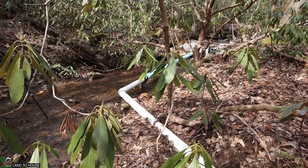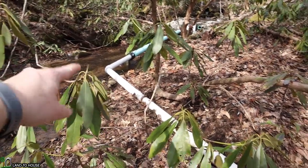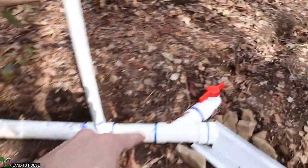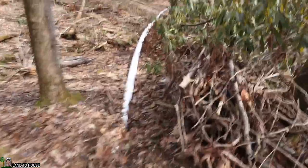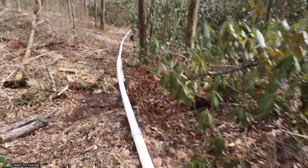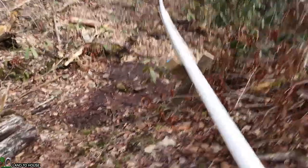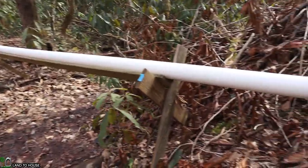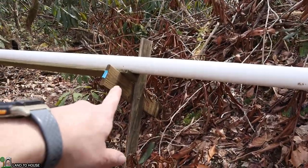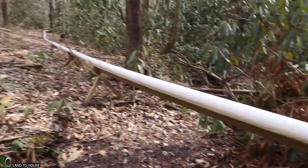This particular creek can have flood stages with over 700 gallons a minute, so the homeowner has moved the pipe away from the creek. It now travels down over here and will return to the creek after going through the turbines. A simple bridge system has been made to allow the pipe to go over a little dip without creating a spot that rises back up — just a couple of cross pieces of wood with decking boards underneath to support the weight of the pipe.